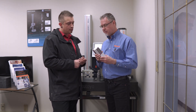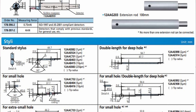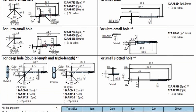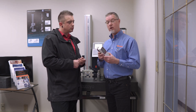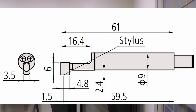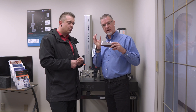If you wanted to jump up to the SJ410 series, that would allow you to use a skidless style detector, which allows you to detect surface roughness over wavy or radius material. It also allows you to get into much deeper and smaller grooves. On a skidless style detector you have almost like a needle, and you can get different lengths of needles to go into a very narrow groove.